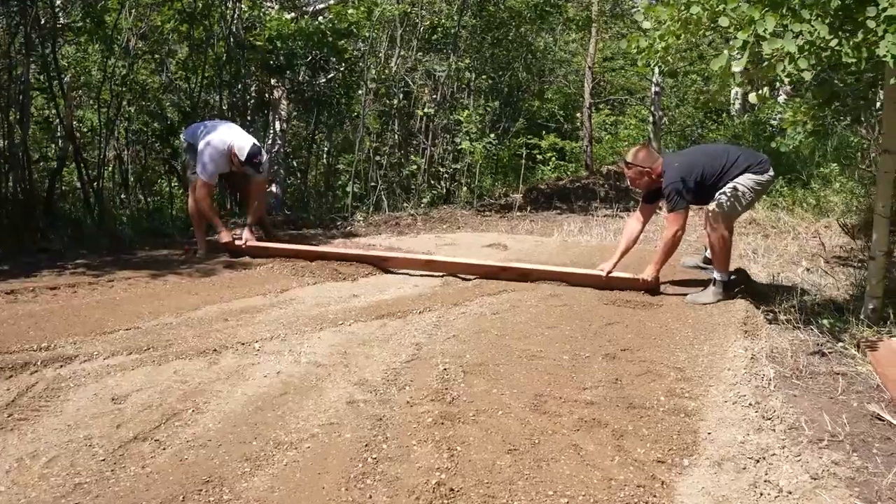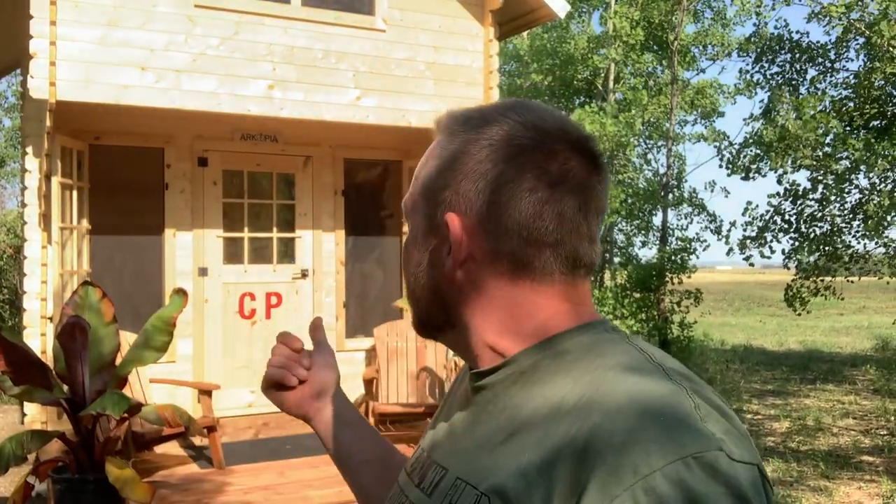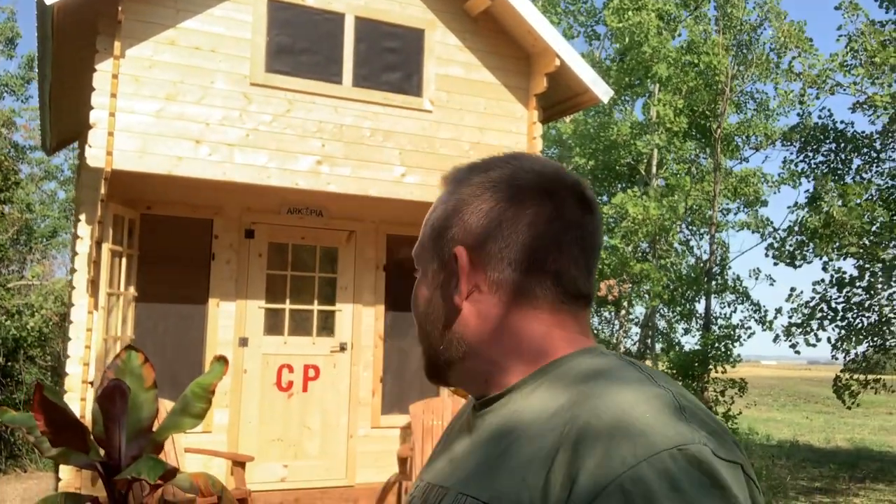I considered drilling in some posts past the frost line — six-by-six posts like a pole shed, just four of them. But what I ended up doing is just putting it on patio blocks on packed gravel. I wanted the steeper roof facing south. We used the brush cutter, took down the poplar, cleared all the natural organic material for the space, put down landscaping fabric, four inches of packed gravel, and then put down some patio blocks.